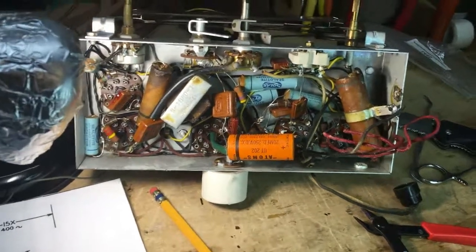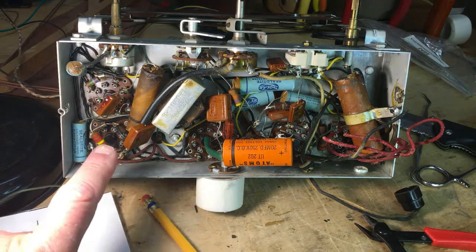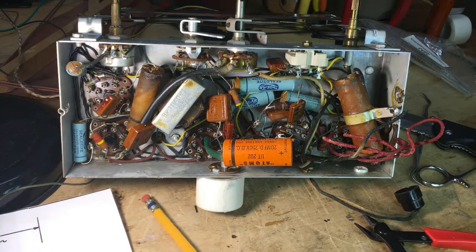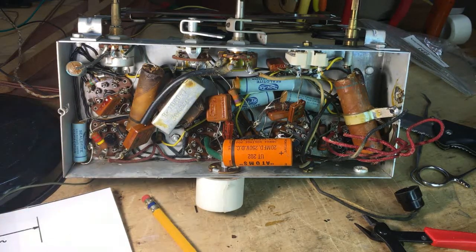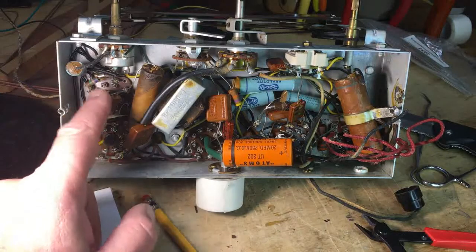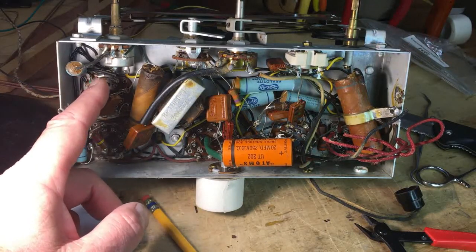Okay, I have started going through this Aviola. I've put this on the back burner. According to the schematic and the parts list, this should be a 470K or 420K. 470K. That's 220K. So that may be why this 12SQ7 was bad.